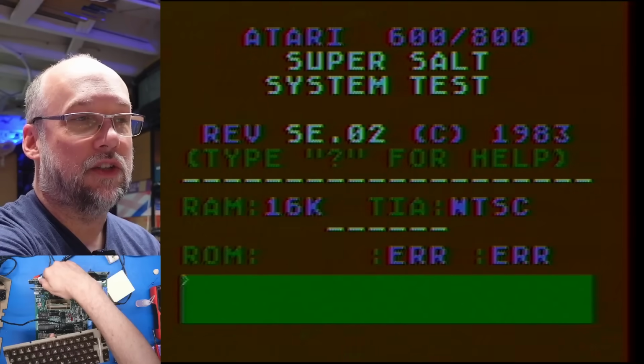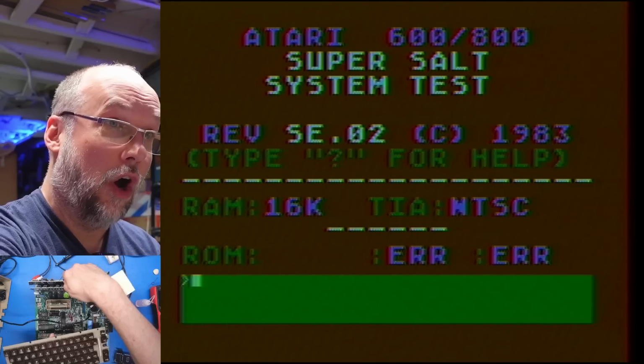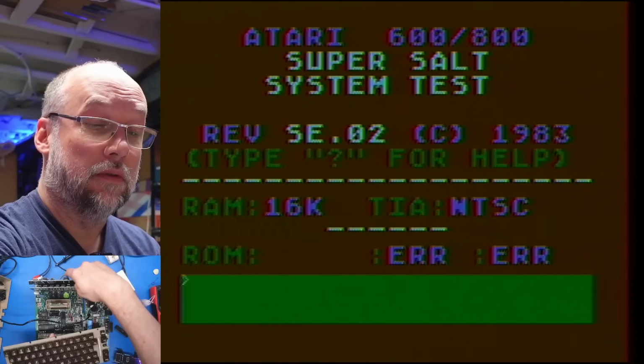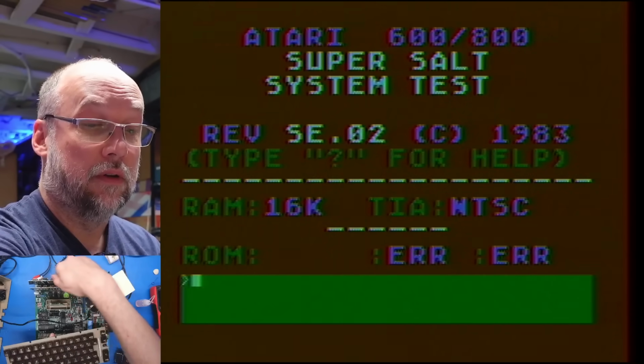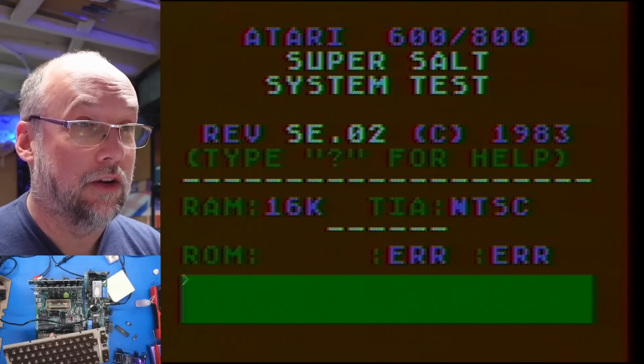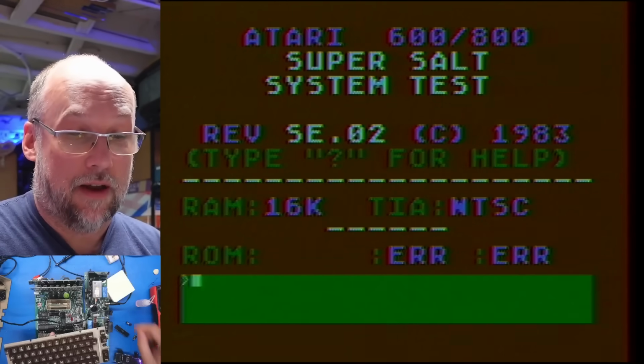Well, but you can see right now that it's working. I'm just feeling the chip right now. It doesn't feel specifically hot at all. It feels normal, similar temperature to the other ones, just warm. Maybe I should hit it with some hot air, and I can also hit it with some freeze spray. We can see if either of those cause it to misbehave.